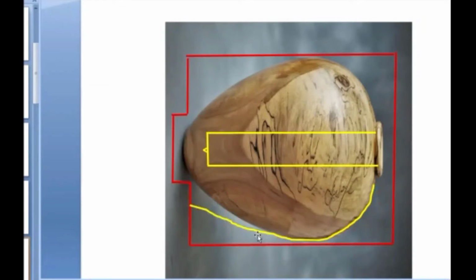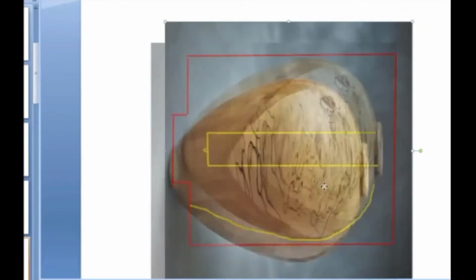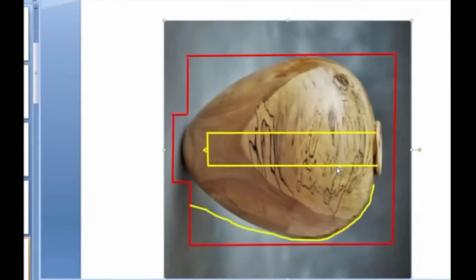Okay. So then when I hollow, I will go down like this, enlarge the hole as much as I can. And this is all with the straight tool. Maybe I'll do this, clear out as much as I can. And then I'll start approaching, get out a bent tool and get partway around the shoulder. And again, I'll leave the wood relatively thick down here, but I'm getting thinner here. At this point, then I'll stop.